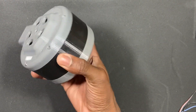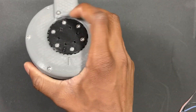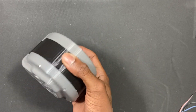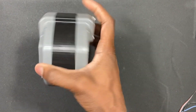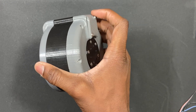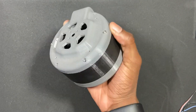The optical encoder wasn't absolute — every time I turned off the Arduino and back on, it didn't know its exact position. That's why I added a hall effect sensor to this one, but I had trouble with the interrupt and it was all a big mess. I also didn't like how it wasn't perfectly circular, because that's where all the wires go through from the optical encoder and the hall effect sensor down to the electronics.